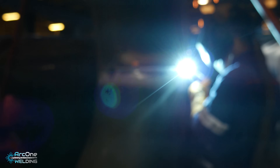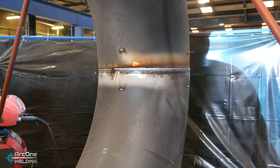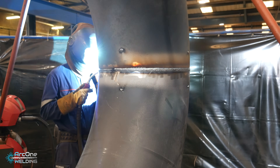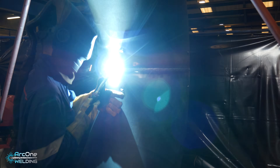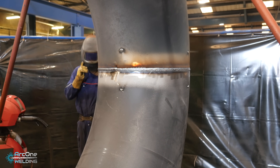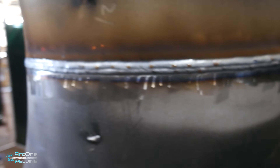This is quite big pipe, so without realizing it I could have been doing the first run at around 180 to 200 amps. For the second run I definitely turn down the power and change my torch angle a little bit, because you need to be more square and horizontal onto it. If you look at my position now I'd lift up my elbow a bit more so the torch isn't shooting up too much. Like I said, it's all by feel. I was also panicking because I'd melted my mask - you can see the screen is a bit distorted. What's never happened to me before is the glass lens on the inside went black and I couldn't see; it was completely destroyed. But once it cooled down it went back to normal. Looking nicer and nicer, and I think it came out pretty good.